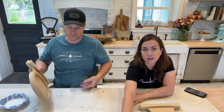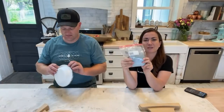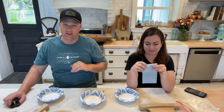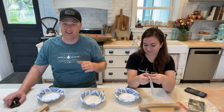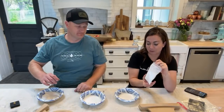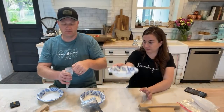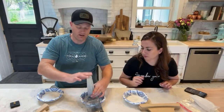We included milk paint in your kit. Be careful — milk paint is a pigment powder, which means if you open it and it explodes everywhere, don't clean it up with water first or you will have made paint. We usually brush it up as much as we can, then vacuum, and then get the water out. You get about one ounce of paint. Add a little bit of water at a time because if it gets too watery you're out of luck. We're going to see if we can do two clocks with one kit.